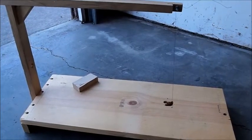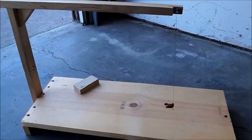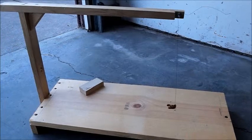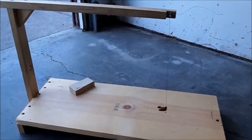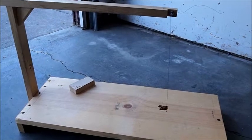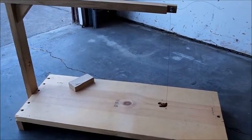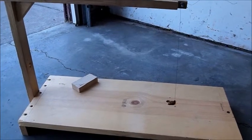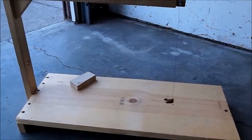The last one I showed you was the bow hot wire cutter. This one is basically a bandsaw type so that you can cut straight 90 degree angles and flat angles on your foam. I use this for pretty much anything that I want to cut a fuselage out of.